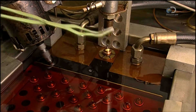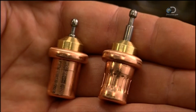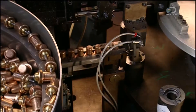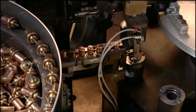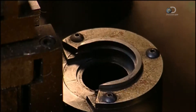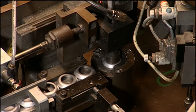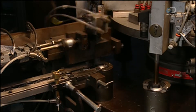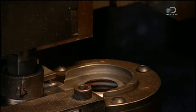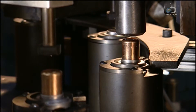Now the parts are heated to the temperature at which the engine cooling system should kick in. A calibration machine squeezes the cup until the pin rises enough to open the coolant valve. The components then enter a machine which connects the valve — made up of two stainless steel pieces — loading one on top of the other over the thin end of the cup, then pushing the valve over the end of the cup and attaching it to the wide end.